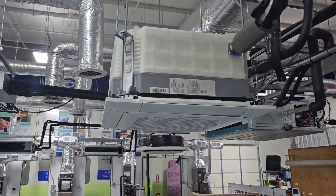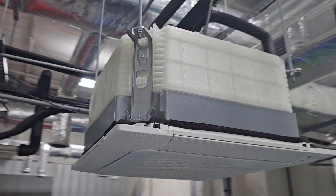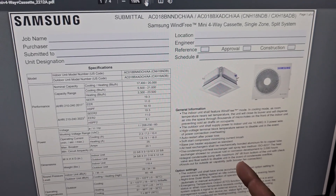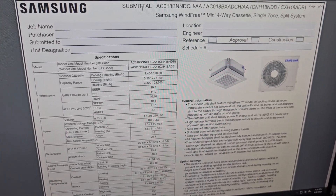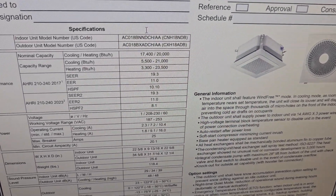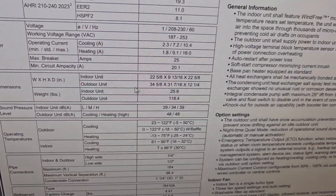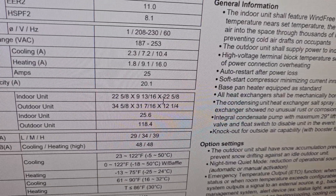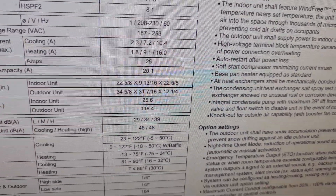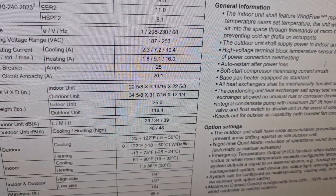This mini cassette has a body measurement of 24 inches by 24 inches. Here's the submittal for that mini four-way cassette — you can get this on samsunghvacdownloads.com under technical documents. The dimensions for the actual indoor unit are 22 and 5/8 by 22 and 5/8 inches, and it's about 9 and 13/16 inches in depth.